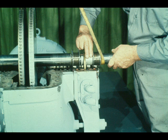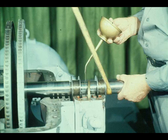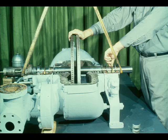The bottom halves of the sleeve bearings must be rolled into position before the rotating assembly can be lowered into position. Make sure that the bearing locating lugs are in their proper location in the bearing housings. Now coat the bearings and shaft bearing journals with a light coat of turbine lubricating oil. The rotating assembly can now be lowered into the bearings.